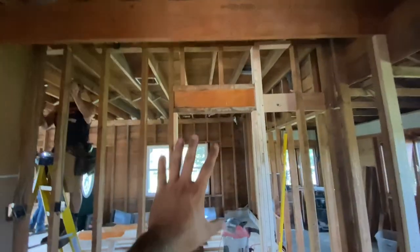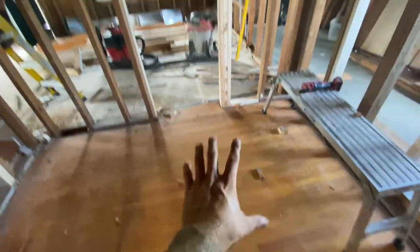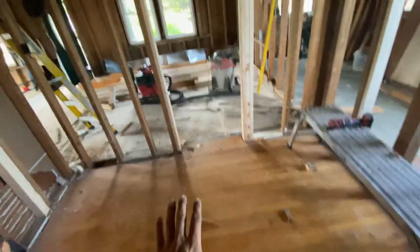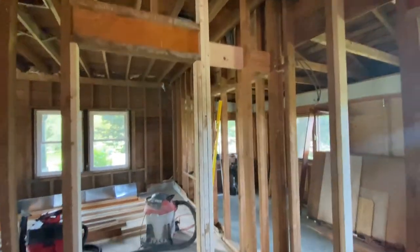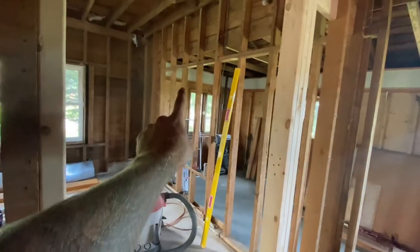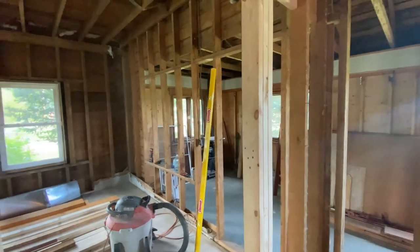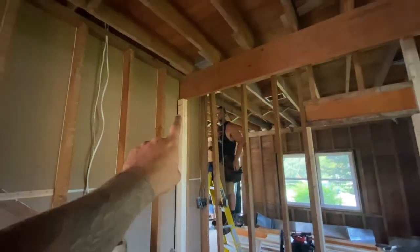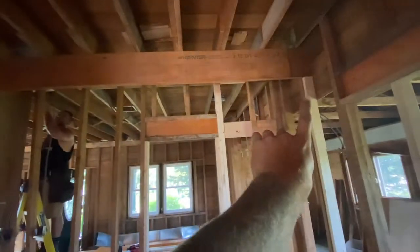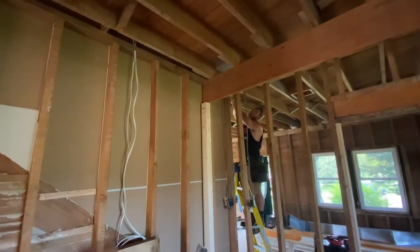Then we've got a doorway here — there's a half bath going in, so there will be a toilet and a vanity. We threw in a block in here because there's going to be a barn door. Then all we've got left is we filled in this whole front wall because there needs to be no openings into the porch. Next up we've got to continue this, which is also going to double as an HVAC chase, through the stairwell and into the kitchen.